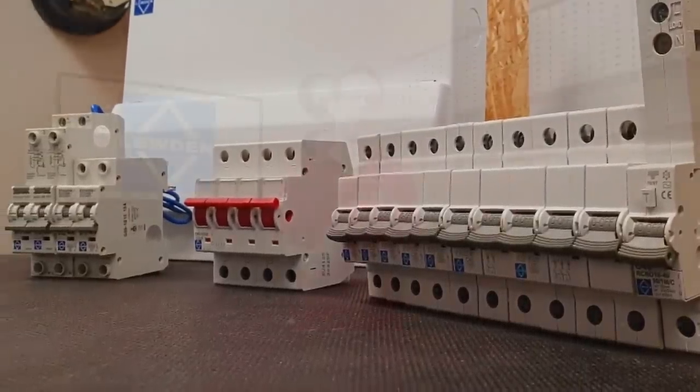First of all, let's get right down to fundamentals and think about what we need to protect our circuits from. When we install a conductor and run electricity through it, the conductor starts to get hot. Generally speaking, this isn't damaging to the conductor itself — copper wires can carry a surprisingly high amount of current before it literally melts. However, the heat can cause damage in other ways, such as melting the insulation surrounding the conductors, and can even damage the fabric of the building, even igniting a fire. And it's these things that we need to protect against.